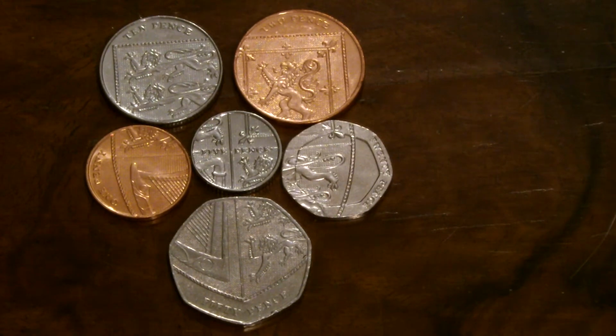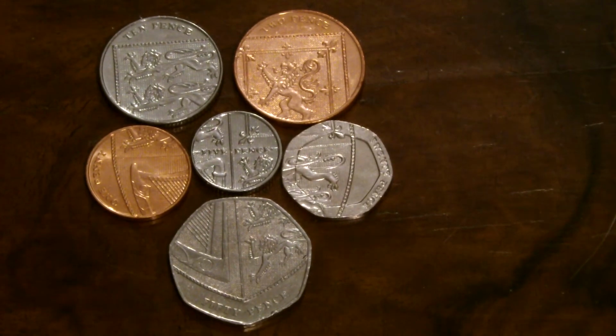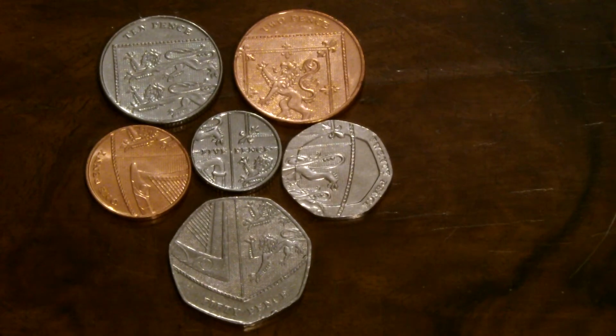Iron-based materials, particularly steels, are different, because steel isn't actually pure iron. It's an alloy using carbon, and it has a very complicated phase diagram. And basically it can form lots of different kinds of crystals. And the long and the short of it is that you can anneal steel by heating it up and then allowing it to cool slowly, but it's difficult to do.